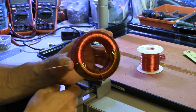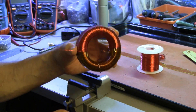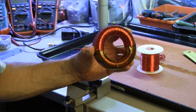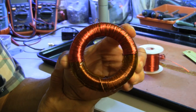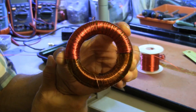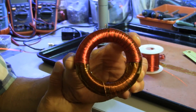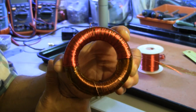Not a showstopper — remember, this is an experimental yoke. This is not meant to be a put-into-service type of yoke, unless of course I can make it a practical yoke. But at this point this is a grand experiment. If it works out in the long run, maybe I'll make some more, maybe I'll find a smaller core for these tubes, because this one's a bit large. For a larger CRT this might be okay, but then it would need to be driven at even higher current. Driving the yoke at high speed and high current gets to be problematic — you need a very powerful driving amplifier. For the experiment, this is as small as I could make it — the smallest core that would fit over the neck of the tube.